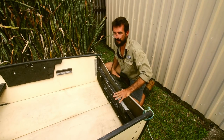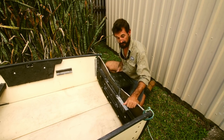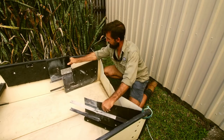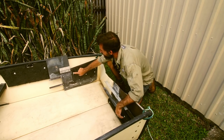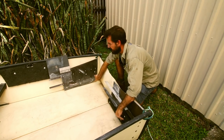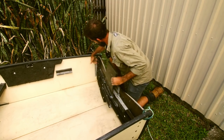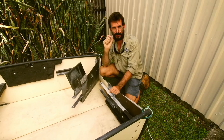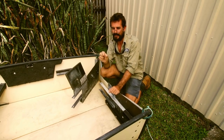One of the engineering innovations of the folding boat is the folding transom — so they don't need a solid transom that's a storage issue. It's not a bad idea, but over the years of pretty hard use it's shown up a few faults. The channels that make up the backbone are mostly riveted in, with a few pan-head bolts, but they fail. At each end of the channel and in the middle, I'm going to replace the rivets with six-millimeter quarter-inch machine screws with a nylock nut. I'll continue using rivets down the middle, but those end ones seem to have the most stress — when the rivets fail, the metal comes apart and chatters against itself, making a horrible noise as well as wearing on the boat.